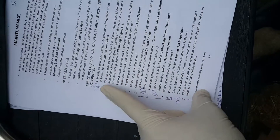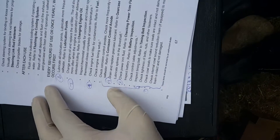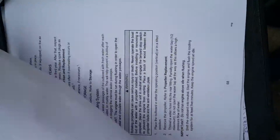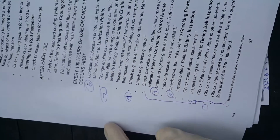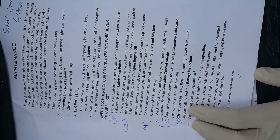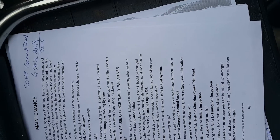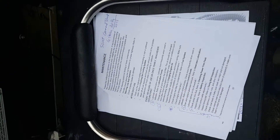We're not going to be doing these in sequence — this is the annual maintenance of the 50 horsepower 4-stroke. I'm going to first do all the checks of the engine, because it's just logical. We'll run through the whole engine, do all the checks, check all the mufflers and boots, then do the oil change, followed by gear case lubricant. We're not covering the battery here — please inspect your batteries every time you go out on the water. Then we'll do power trim fluid checking, fuel filter checks, and lubricating everything.